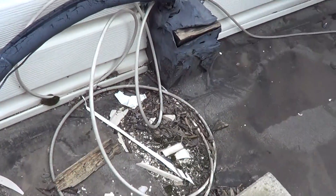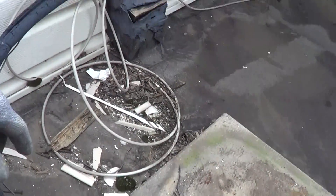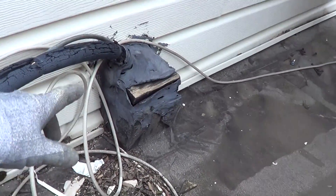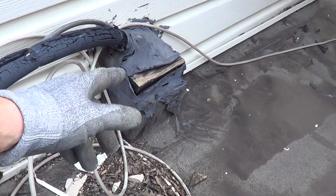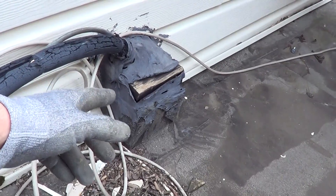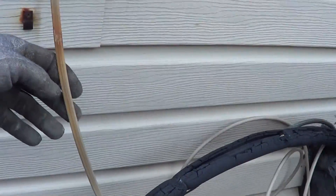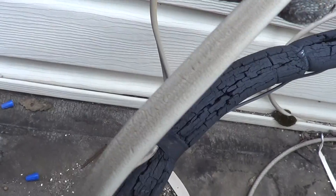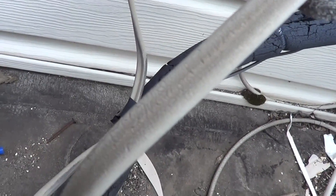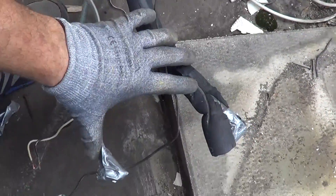A couple of other things I'm going to do out here: I'll clean off the pad. I'm keeping the original pad because the roof will be changed out — that's when the pad will be changed. We've got a serious leak right here on the roof jack and I'll go ahead and fill all that in. Then I'm going to change the wire — this doesn't look like it was outdoor-rated wire and it's starting to crack. So I'll change out the wire here and then solder up the pipes.